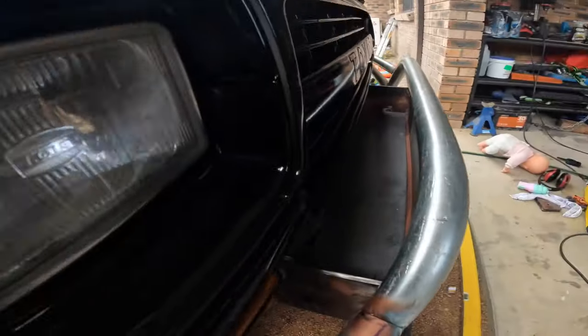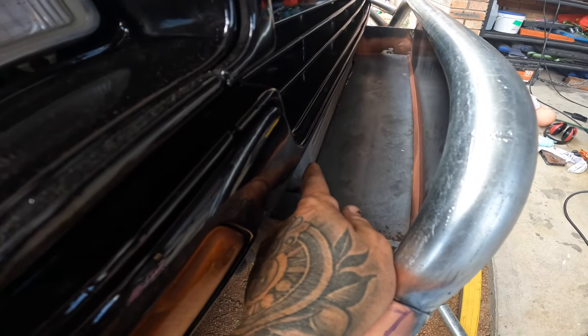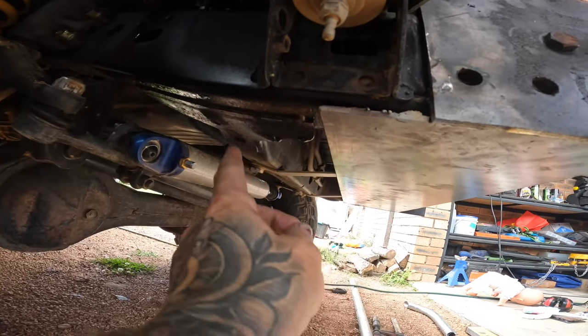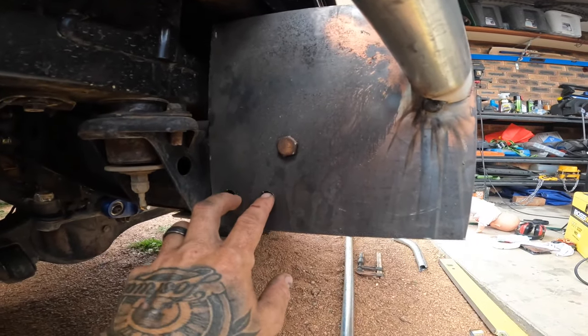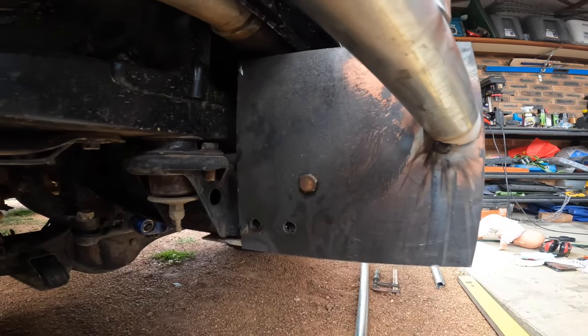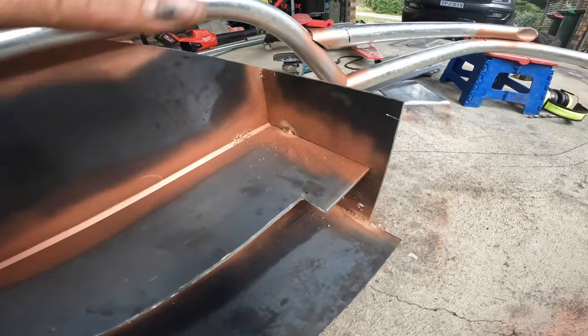That's cut now — we'll try and put it in and see if it fits. We've just tacked the winch plate in and there's a decent gap between the intercooler and the plate on the bottom. There are some bolts under here holding the intercooler — I might shift them a little bit and give it more room. I've got two on the bottom, a bolt inside, so two, five, six bolts on each side — so each side's got six bolts, 12 bolts total holding it, which should be plenty. Everything will be fully welded together and I've sprayed a heap of copper weld-through primer on everything.